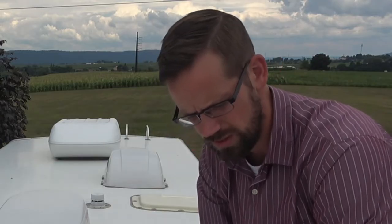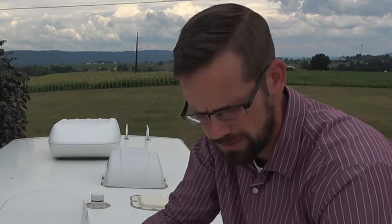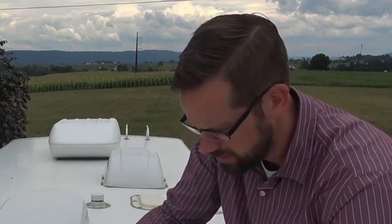Today I'm working on the front AC on top of my camper. It's been having some hard start issues. Plugged into shore power it's fine, but if I'm plugged into my generator and I'm running both the front and the rear AC, when the compressor on this one kicks in sometimes it'll really bog the generator down. The issue I'm fairly certain is the start capacitor. I've already been into it and looked at the start capacitor and it looks like it's leaking out the top, so I think that's gonna be the issue.